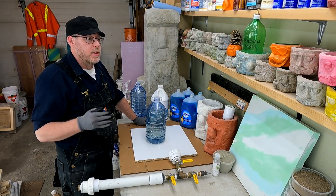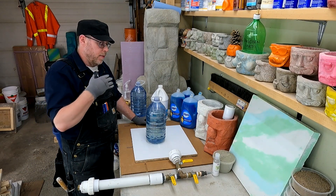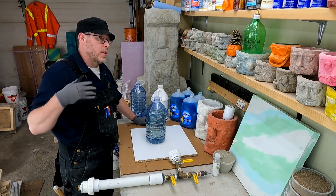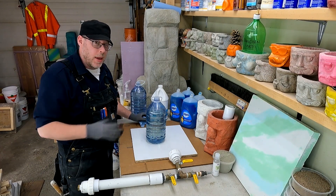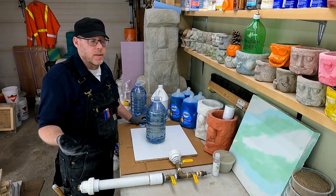One of those drawbacks is that calcium is an accelerator for concrete set. If you use water with a high degree of calcium hardness, it will set concrete quickly — which I'm going to do when I mix my cement and water later. But for making bubbles, really hard water is basically the worst thing that you could possibly use.